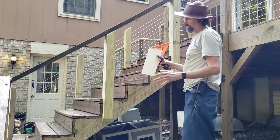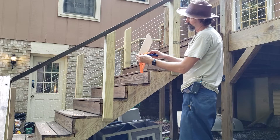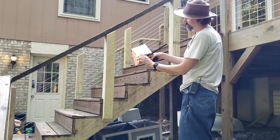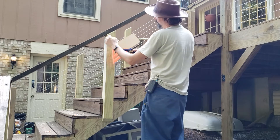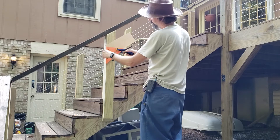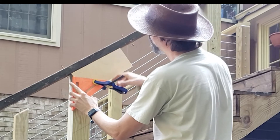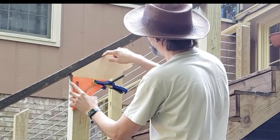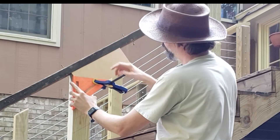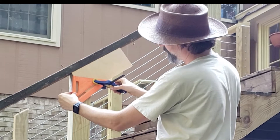To get the angles correct, I made this alignment jig using a piece of thin plywood and a bevel square. This angle right here is approximately 35 degrees relative to horizontal. I first set it up here and aligned it with the top of the handrail to set my angle for this piece of wood, and then clamped it to the bevel square.